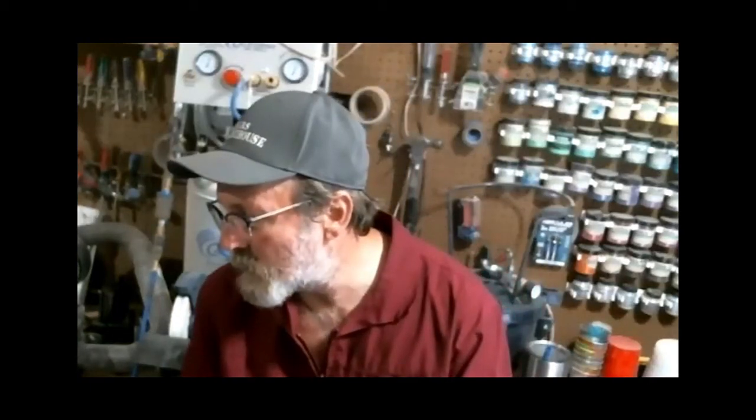The problem with these little pots is that they tell you they're good, they're rated to 60 pounds or rated to 80 pounds. Well, that's the guys putting a sticker on them. Nobody ever tests them, these Chinese pots. And the only way you're going to know if you're getting a pot that is truly tested is if it has a metal sticker on it. And there's only a few companies like Binks and California Air Tools that actually go to that extreme. So know your pot and just push your resin to that.